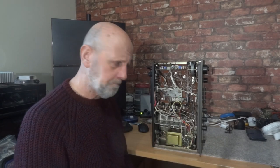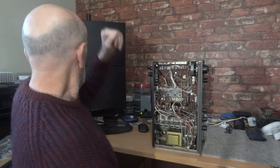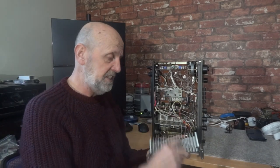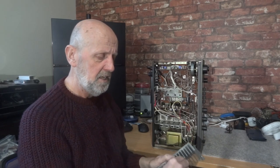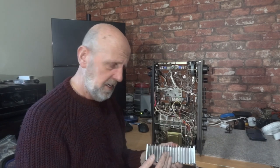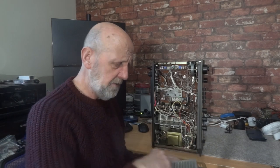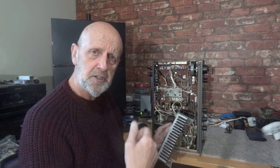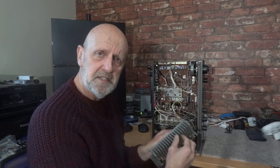I've used a different glue this time. You may have one where your fins — these are the fins inside the transformer, magnified up a bit — are stuck together with glue. Each fin is stuck together with glue inside and that glue has to be fairly thin to get in between the fins. Rather than completely taking the transformer apart, if you can actually see a gap between the individual fins, you may want to get a paintbrush and some varnish and paint that — it's so thin it'll drip down between the fins and seal them.